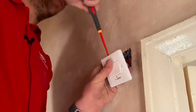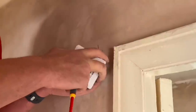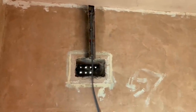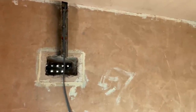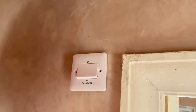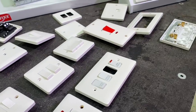What I have started doing for some people is installing a humidistat fan — that takes away the concern of whether it's been left on or not. The hole cut in the wall for the bathroom fan looks a little less round than square at the minute — an interesting hole saw. We ended up rotating the hole saw, so it's a square hole. The customer wanted the fan exactly there and there was already an air grate out, so we'll put a four-inch ducting straight out. I think we've learned a couple of things today — if you need mates' rates, Will's your man. What are your thoughts on the MK Base range? Great — loved it. Leave your comments below and I'll try to get back to as many as I can.